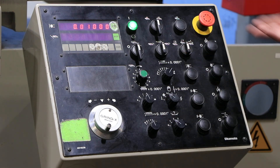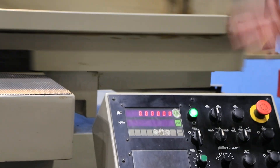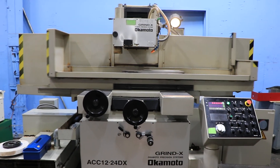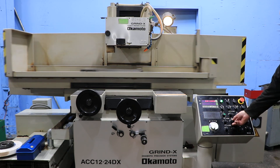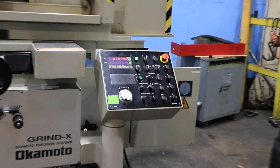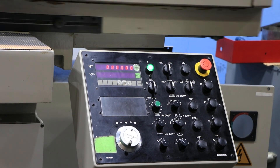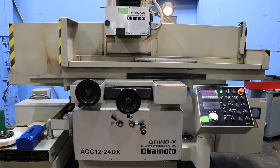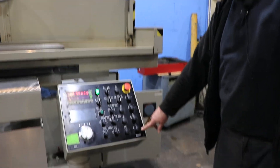I'm going to flip this over to plunge grind so we can complete this quickly. What you would do is use your rapid feed and jog to touch off on your work piece, measure it, and find out you need to take off ten thousandths. At that point, if everything else is ready, you go into the next mode — the running mode. So it goes down one thousandths each pass until we get to one thousandths, then we go into tenths. When we're at zero we do a certain number of spark-out passes, which you also set here. The other knobs are for hydraulic pump start, spindle start, coolant start, and dust collector if there is one.